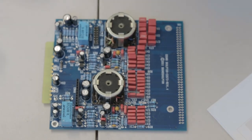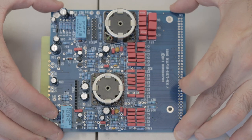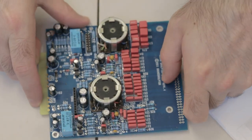Brush the board with a toothbrush to remove any remaining soldering bits — and that's basically it for the main PCB board. In the next videos we'll be doing the components on the other boards for the switches and all that cool stuff, so stick around. That's it for part one of the EQ 573 build from Sound Sculptor — I hope you've enjoyed it. Don't forget to hit like and subscribe and hit me up in the comments if you have any questions. I'm Mitch from diyrecordingstudio.com and I'll catch you soon.